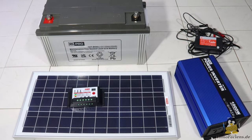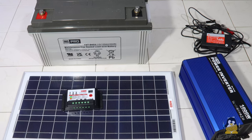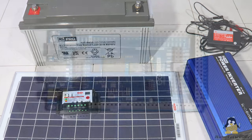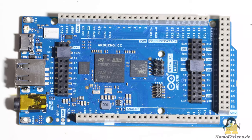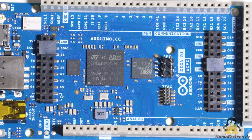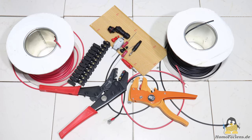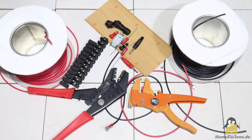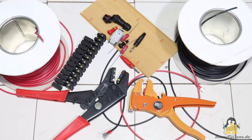The core components are identical: 20W solar panels, a lead-acid battery, a solar and a mains charger, and a 1kW inverter. A microcontroller is essential for my projects — I chose an Arduino Giga, which can be connected to the outside world via WLAN. My list also included waterproof sockets, current sensors, and some more small parts.